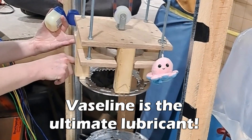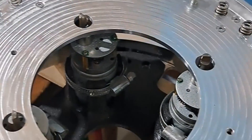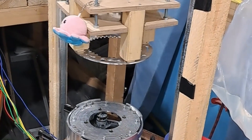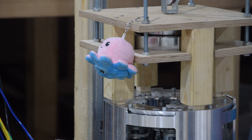A couple of weeks later we came back to the lab to try again, this time armed with a couple of changes. First, we brought lubricant to grease the ring so it slides better on the springs and in the grooves for the screws. Second, we designed some inserts to put over the top of the springs to reduce friction on the metal rings — the springs end in a very sharp point which can dig into the ring as it rotates, creating a lot of friction, so a smoother head on top helps achieve a smoother rotation. Finally, we reduced the dummy weight to the correct five kilograms. So we were ready for the third round of testing — the true test of whether this system can deploy our nose cone in the depths of space at 100 kilometers altitude.